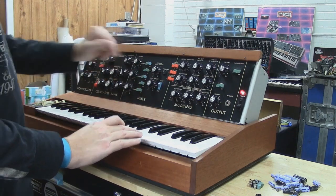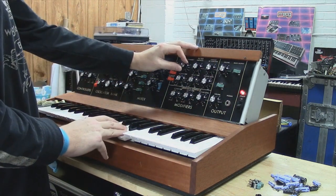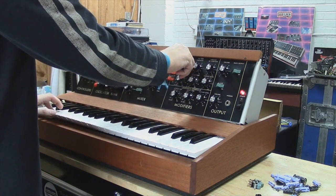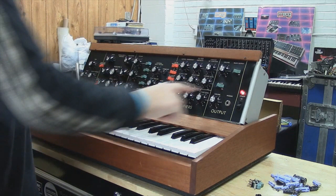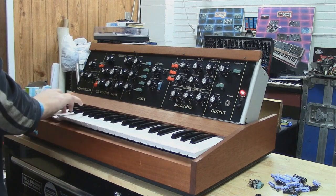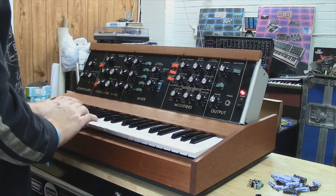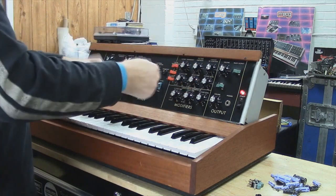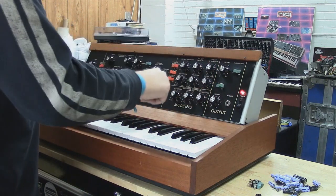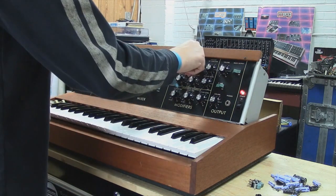There's your noise source and all your oscillators. Now let's go to the filter — we'll make it self-oscillate here and turn it to 440 hertz. I put the back panel on since I calibrated the filter, but you can hear it does track pretty well. Once I calibrate it, it'll be a little bit sharper. Filters never hold exact because they're just filters — they don't have all the thermal compensation stuff like the oscillators.